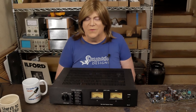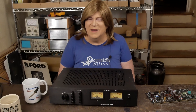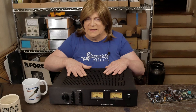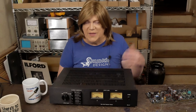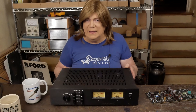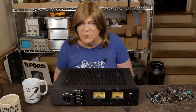Hey y'all. We're going to talk tape head preamps. You might say, what's a tape head preamp? Basically, tape decks normally have the electronics inside the tape unit itself. The tape unit has a line level out that goes into your amplifier. The problem I'm trying to solve is that most of the tape decks sold in the U.S. are NAB only.